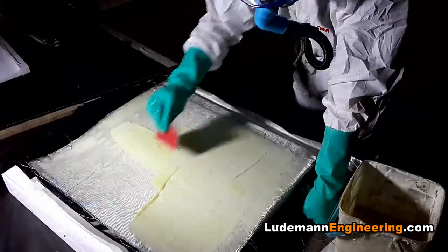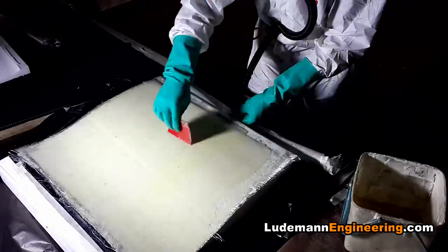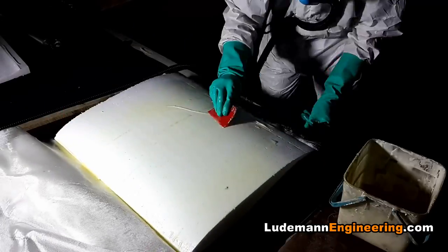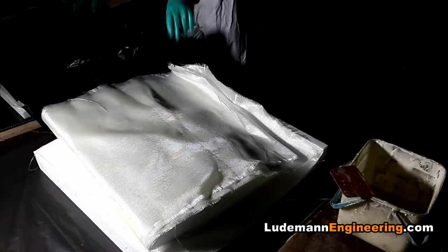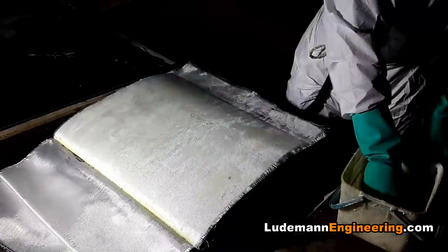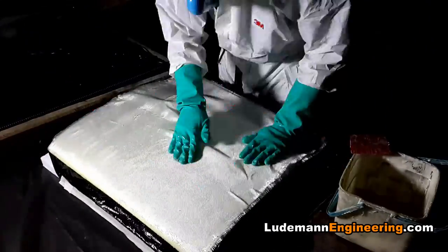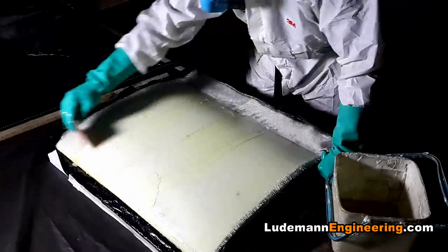You can see that I'm only doing one side at a time. The extra cloth is rolled up at the front there. In a minute we're going to flip it over and apply the cloth to the bottom of the airfoil. First we stretch it nice and straight and taut so we don't get any bunches at the front of the airfoil, and laminate both layers of fiberglass cloth to the foam.